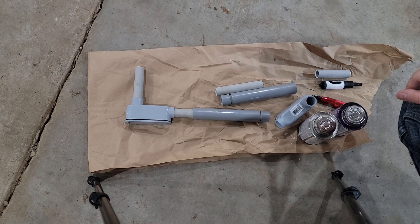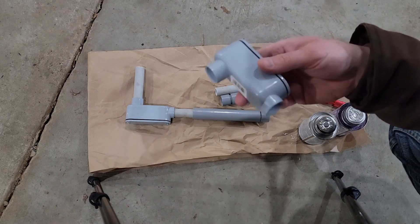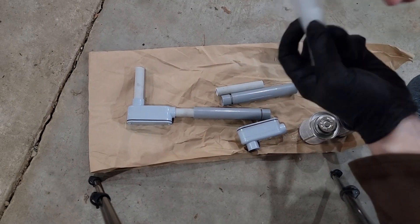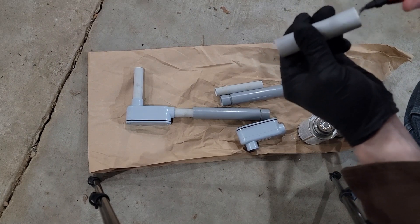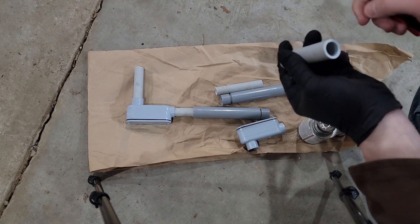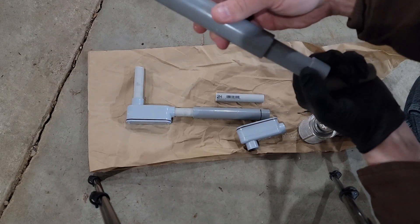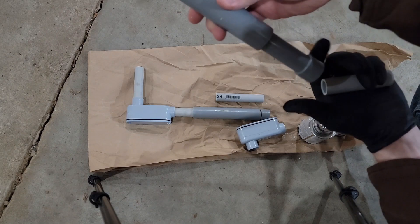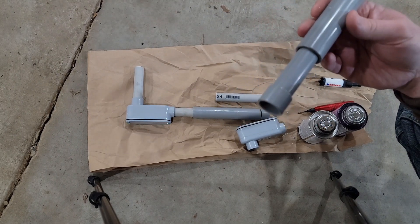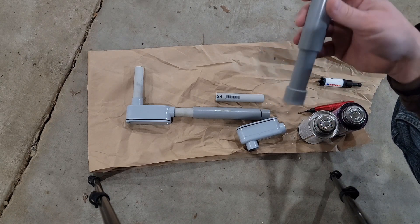So I've kind of got rained out of my project today, so I decided I'm just going to go ahead and do the prep work on getting these LBs ready to install. I went ahead and cut some pipe pieces, and I like to deburr the edges so there are no sharp edges when I try to fish wire through there later. I'll be adding the expansion joint — it has about 5 inches of maximum range but I'll put it in the middle. Most of my conduit is between 18 and 24 inches deep, and that's above the frost line in Kentucky, so this will allow the pipes to float as the weather changes.